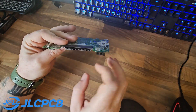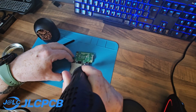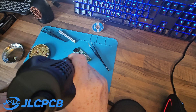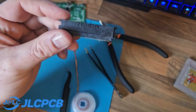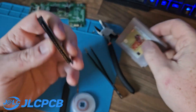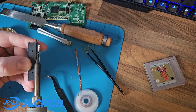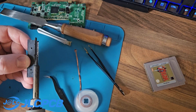I ordered Game Boy connectors from AliExpress but they were taking forever, and I had loads of spare DS boards lying around, so I decided to cannibalize one and pull the connector off the DS. First I removed the DS card because it was in the way, then I took my heat gun with loads of flux to the pins, and with a bit of patience it eventually worked its way loose. Now we have to clean up the pins — get any excess solder off — because we want them nice and clean for going onto the GB Interceptor board.